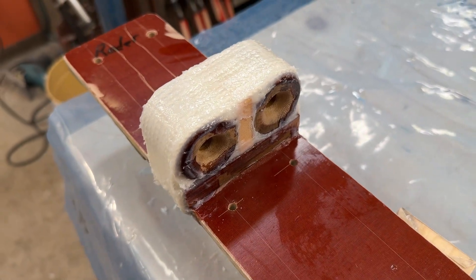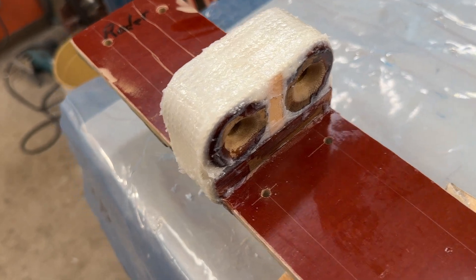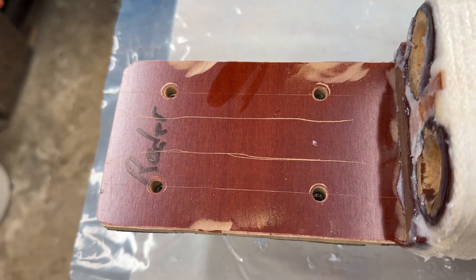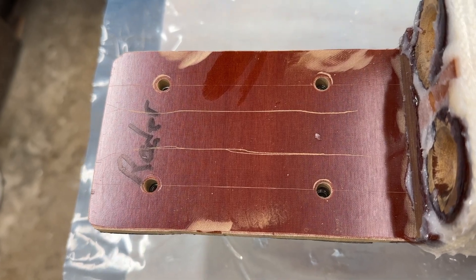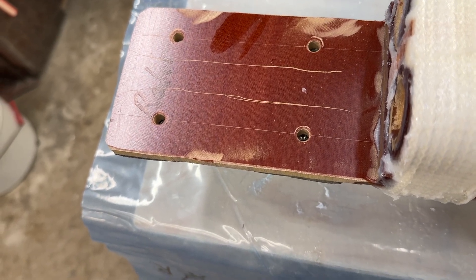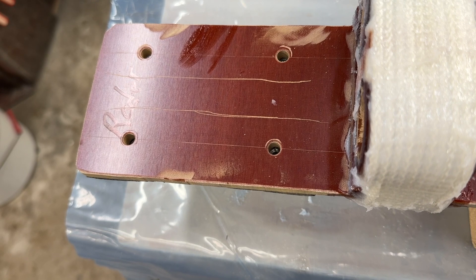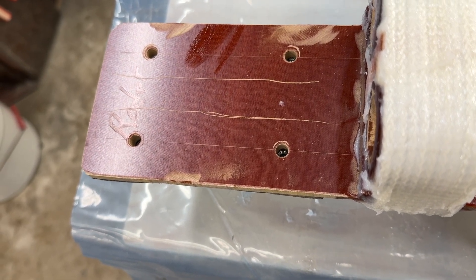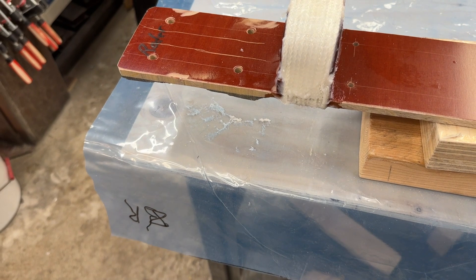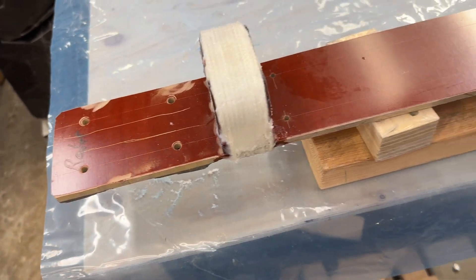I like to have things at sea secured by two strong things — it makes me feel good. For example, after a few years, maybe one of the clutches would start acting up. Maybe the screw had corroded a bit and I had to use force. With ordinary nuts, maybe it would slip and then I'd be in real trouble — I couldn't change it, I couldn't get it away, and I'm a thousand miles from port. Now with the wing nuts, there's a magnitude more strength. So that's the thing.